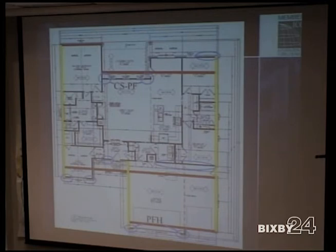Do I have enough bracing? Are my brace wall panels compliant in regards to the end, 12.5 feet from each end, or each end combined, depending on the method? And then, are my panels less than 25 foot on center apart? Question. So the next one, just one sec, we'll get this last one here.